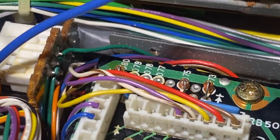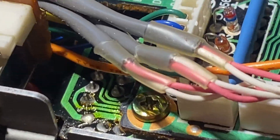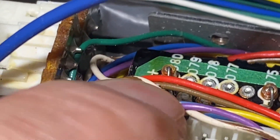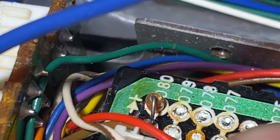All you basically have to do is just clip that diode there, and I'll do it. I'm not going to do diode 66 — I don't have any need for that. But I will be doing diode 80, this one here. Just to show you, there's diode 80, and we'll do that one, which will give me the Mars Mod.